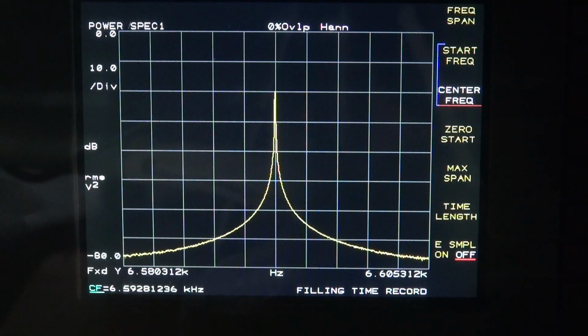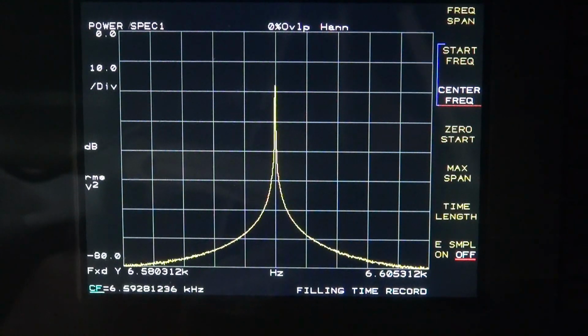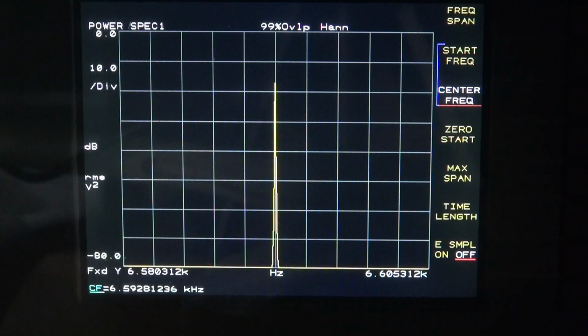Put yourself a little coil in the place of the antenna, and a lot of frequency counters had a little bar graph display. So you could take that little guy and move him around, get maximum amplitude, and you'd be able to read the frequency. And there it is. Now let's move on to another White's machine, this time the MXT All Pro.